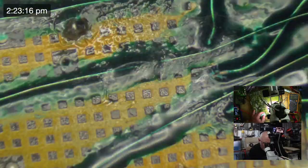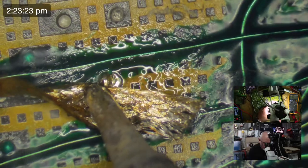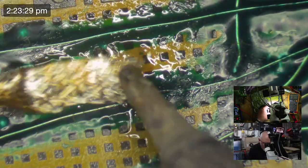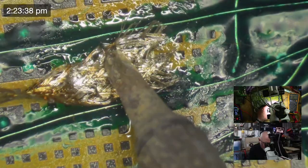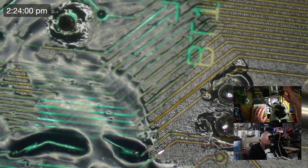There is another thing with this board, and I'm not placing any blame on anyone, because it's my understanding that the stuff done to this board was not by any of the current owners. So it was not done by Javier, it was not done by Steve when it was sent to him, it was not done by Joe when it was sent to him, but someone did do some funky stuff to this board, and it sort of left us with a few really bad looking vias in particular. Okay, so I've whipped off the little battery holder, which came off quite easily because the vias have been so badly damaged, so there wasn't that much solder holding it on.